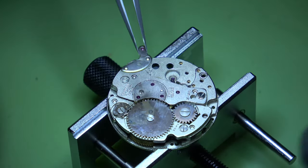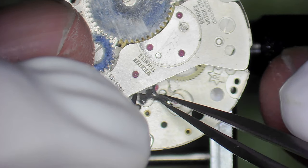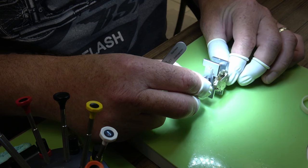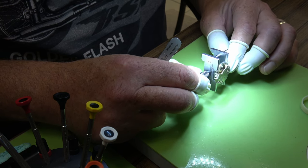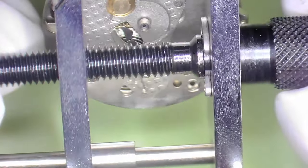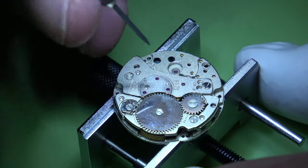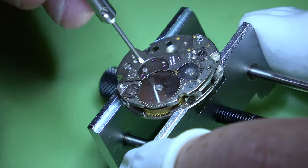Just checking the jewel on that little cock. I'm going to hold the escape wheel, remove the pallet fork, and then let the power out. As you can see, this one is actually a pin pallet. Can you hear that unwinding? I'm having a look at all of the oils going around as the power comes out, and you can see there's no lid to the barrel. The power is starting from the middle and as it unwinds it makes its way to the ends. With the power out we can start to dismantle the movement.